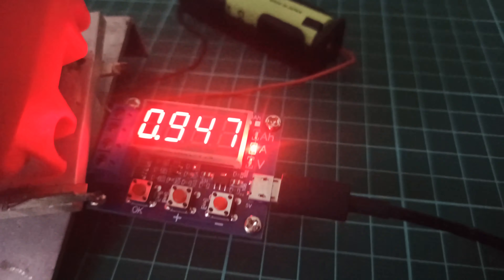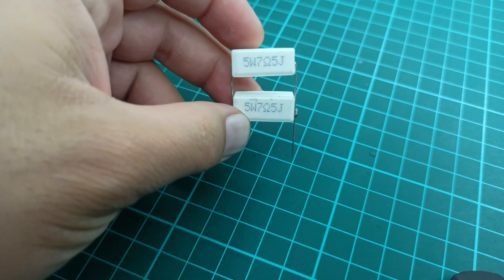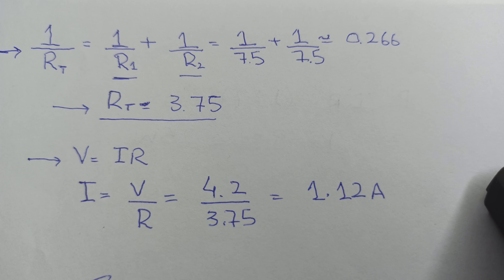Hello! In this video, I will show you an upgraded version of the ZB2L3 battery capacity tester, in which the heating issue of the load resistor is resolved by replacing the dual stock resistors with a single one that can be mounted on a heatsink. In this way the heat across the load is reduced, which will eventually result in extended life of this module.